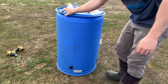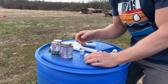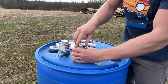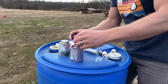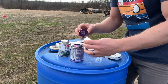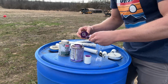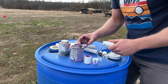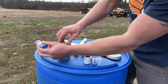All right, those are in. Let's piece together the PVC. We got all the pieces here. Now on all this, you're gonna have to piece it together. You should be using pipe cleaner and pipe glue. And once you get it all pieced together, you can thread everything and you'll be ready to rock. So right now I'm just running the pipe cleaner on all this, getting each piece prepared, and then we will glue it all together. Might as well just go ahead and do a bunch of them since I got it out. All right, cleaner is on everything.